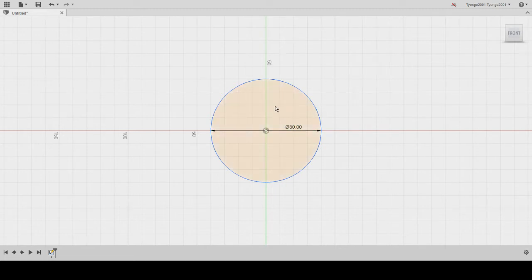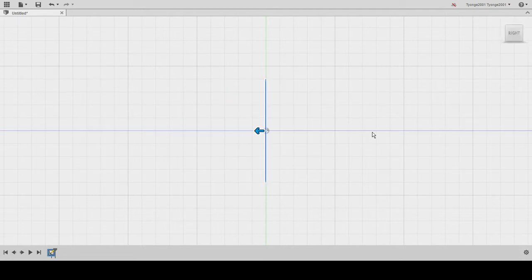In order to make this useful we need to extrude it out. Go up into Create, select Extrude, select our sketch. One critical thing to note is the direction of extrusion — the arrow indicates which way we're going. This is a positive five millimeters, so we type in five millimeters and it brings it out in that direction. When we go to do our text, it's going to be important because our text is going to be inset, so we need to extrude in the negative direction to cut away the spaces we don't want for the letters.